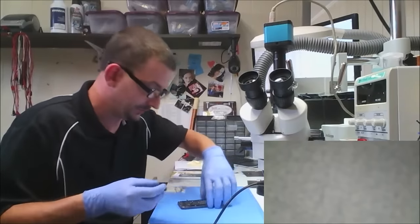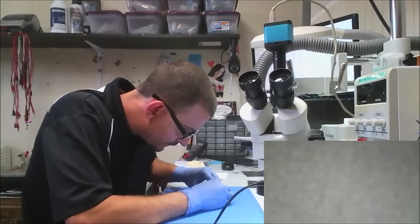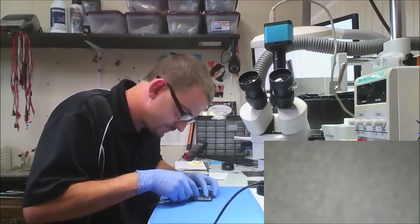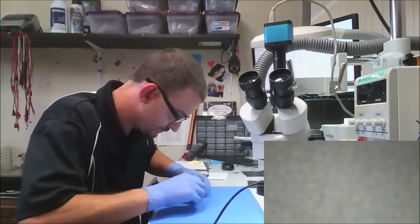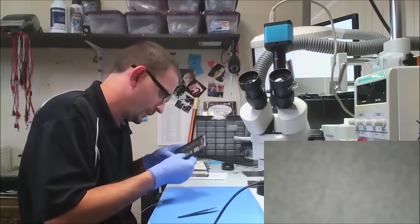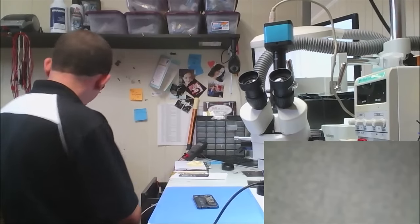All right, camera put on the iPhone 5 board. We're going to plug in our Wi-Fi antenna. Click. All right, let's plug on our dock connector. Power volume flex. Save the battery for last. Grab a test screen. iPhone 5.